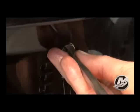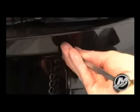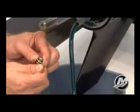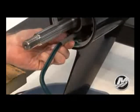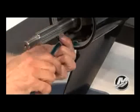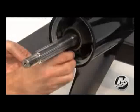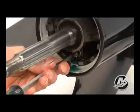Install the vent plug and sealing washer and tighten securely. Clean up any gear lube that was discharged on the side of the gear case. Make sure the sealing washer is in place and remove the gear lube pump and quickly install the fill and drain plug. Tighten securely and clean off any excess gear lube that was discharged.